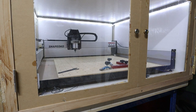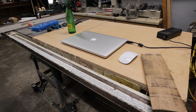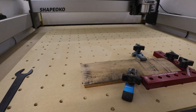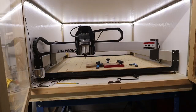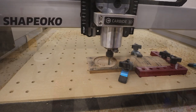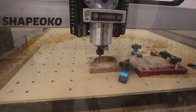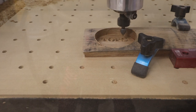Here I am just turning on the CNC and getting everything initialized. I built this enclosure for it last year and haven't really tried it out yet — still got to do a few more things to make it perfect, but it's pretty cool. Just opening the laptop — you can see I already have the design done. Clamped it down with some Rockler clamps and a fancy Woodpecker square. I'm going to go ahead and zero everything out and start the tool path. My speeds and feeds were probably a little slow but I didn't know how hard the oak was going to be. This pocketing tool path took about 35 minutes or so — a little long, but I just sat there and watched it to make sure nothing went horribly awry. After that was done I switched out for a 60-degree V-carve bit and it ran through without any issue, putting the Topps Daily Grind logo in there.